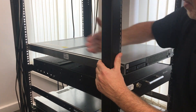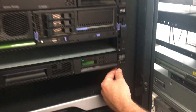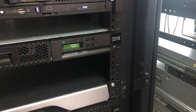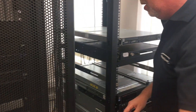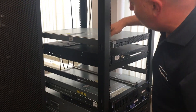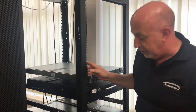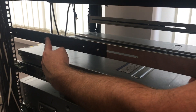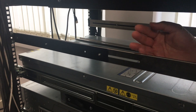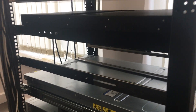This length is what we're talking about. Now, in an IBM rack, these things are bomb proof. They have the round holes and the length between this rail at the front and the post at the back — that's always fixed. It's always the same length in every IBM rack. So in that circumstance you can order your fixed length rails. If you don't have an IBM rack or you're not sure, you should use the variable length rails. These nuts here allow the rails to be extended or contracted to fit into any length of standard rack.